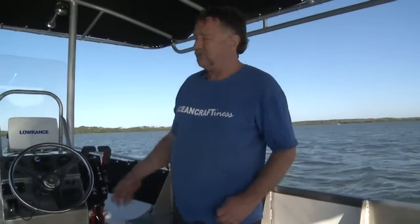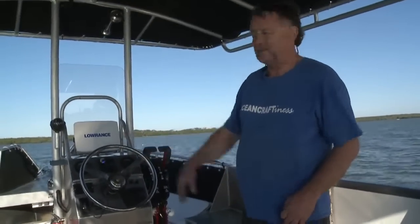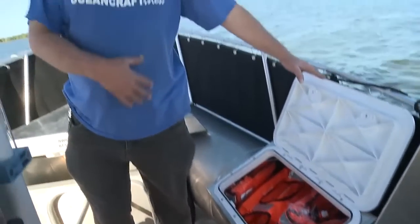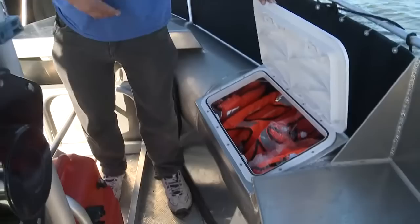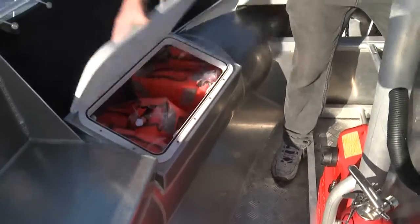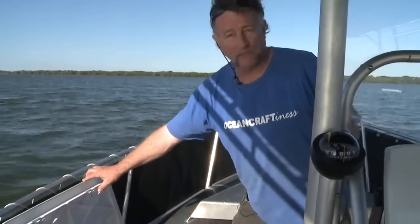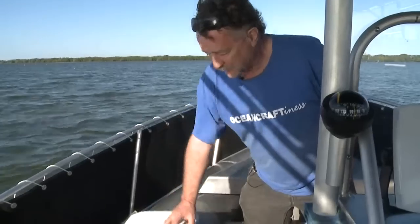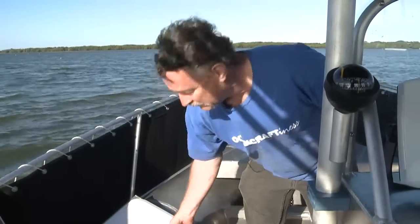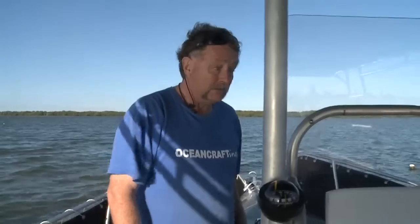With a totally clear deck, you've actually got a ton of 1 cubic meter of storage without even noticing. There you keep all your life jackets and EPIRB flares and all that sort of thing in the airtight, watertight in-tube storage hatches, and same on both sides. These are 250 litres each, so that gives you a massive half a cubic metre for all your other gear. Basically, there's 12 life jackets on board here, coastals, which are fairly bulky, of course, for offshore use. This is in survey for 15 nautical miles offshore for that purpose, in a 25 knot wind.